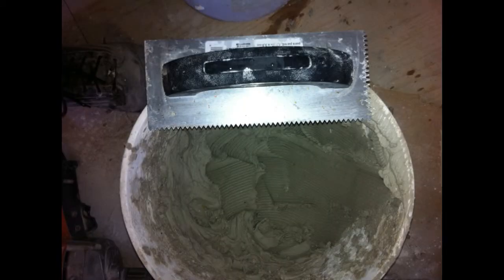And that's the jig, see? The little edge there, the little notch. And this is a V-notch trowel I troweled the thin set on the wall with. And what happened is I came back the next day and it was still a little too deep. So I troweled out this thin set and I just left it, just to give it a little bit more. So when I put my fiddle sticks, my waterfall will be perfect.